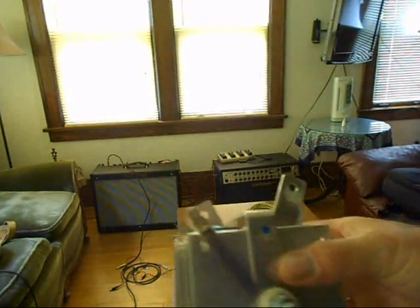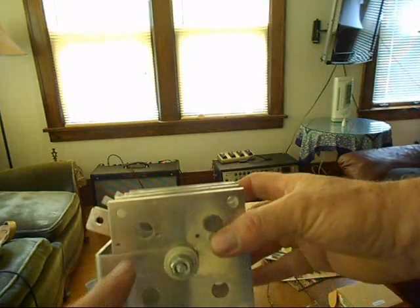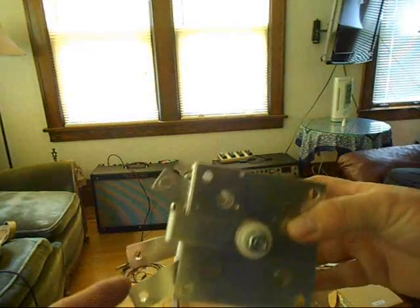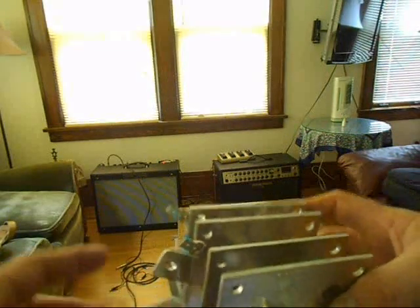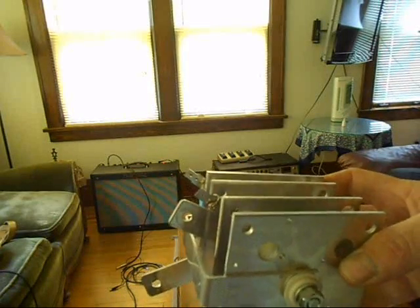Just a comment on taking it apart and getting all the wires back in the right spot — it was actually quite easy. There's a thermal switch that goes here, and I'm guessing that this is the ground. These two are the conductors that are bringing in the 220-volt. This is a 220-volt system, and then these are the DC taps that go to the wire feed motor.